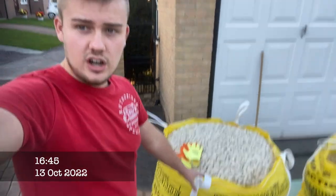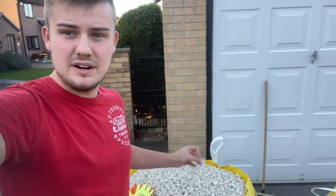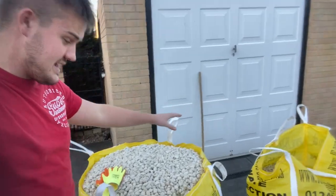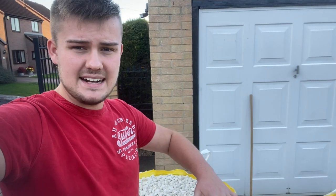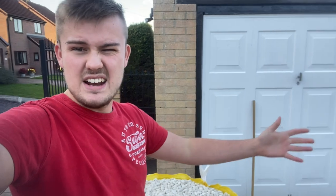So we've had two tons of 20mm limestone delivered — it's a pretty clean mix as well. We've emptied about half a bag of it here and we've got another ton to go. We've slowly emptied it into the pit, and the idea is to provide a nice solid, firm, compacted base that we can then lay the concrete on top of.